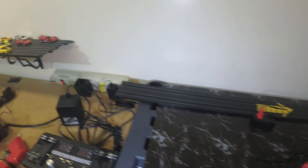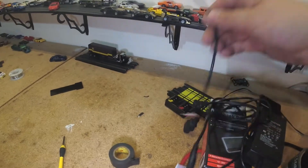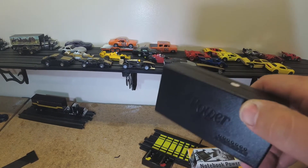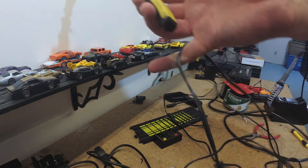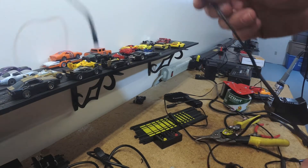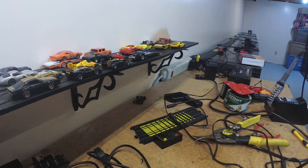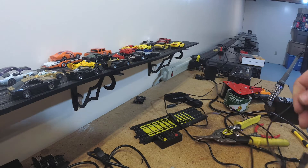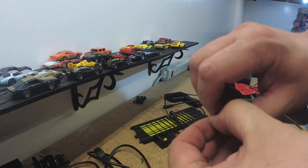Almost! Now that we have that taken care of, we want to eliminate the wall wart. To do that, we're going to wire in this pigtail into the laptop power supply that has adjustable 12 to 24 volts. Remember: when you harvest the cord, harvest from the block side so you have a nice length of original cord — that way you won't see any splice marks in the cord that lays over the table. From the pigtail, just cut off, take the two wires and split them.